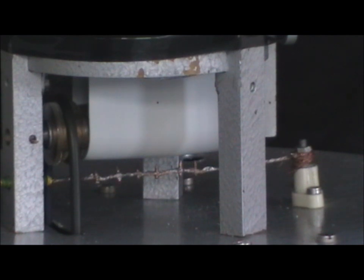Here we have the bottom end of the machine. You can see the drive belt — that's the black bit on the left — and the main belt going round. There's a pulley, in this case made of perspex, and you can see the lower comb. The comb here is made out of a piece of wire that I put bits of nails through and then soldered on. Fundamentally, they need to be points. It's very common to find these machines set up with the combs actually touching the belts — they shouldn't. People always think these things work by friction; it's not really. It's more a question of the belt and the pulley coming into contact and then coming apart again, producing a charge separation through the wonder of triboelectric electrification. Pick the right materials and you get quite a big effect. You can use all sorts of things as combs — bits of grid-type material, ones like this — you can even use a sharp metal edge. Sharp certainly seems to get the effect to work better.